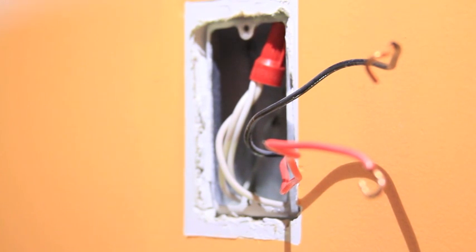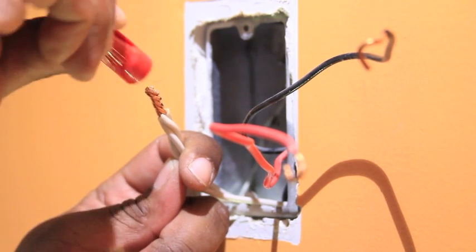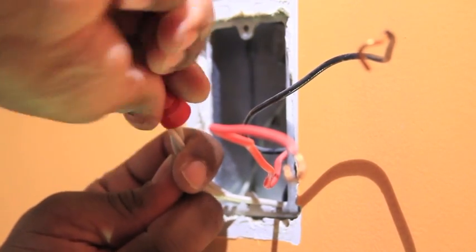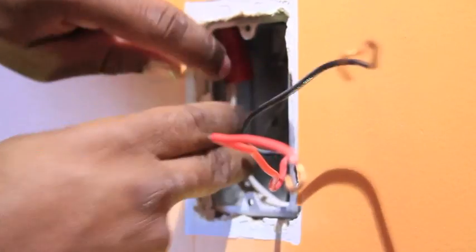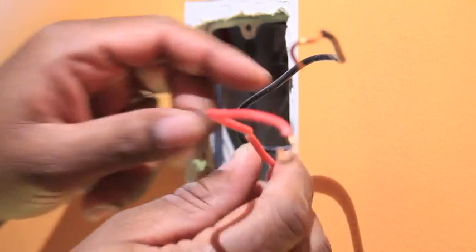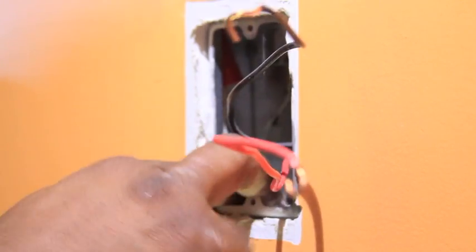While in the midst of your project, being a responsible person — this should not be. Either you want to use your black electrical tape to tape any exposed wire. Always make sure there's no exposed wire inside your circuit boxes. Make sure you cover them up before you install them back in the wall. These are really, really strong tough wires — don't be afraid to push them in there and make sure that they're all the way inside.